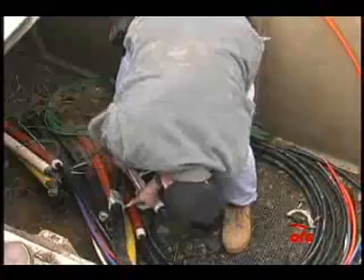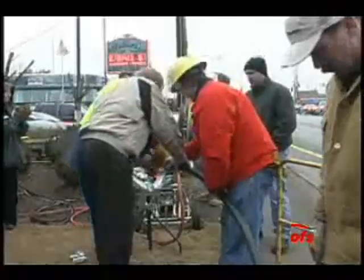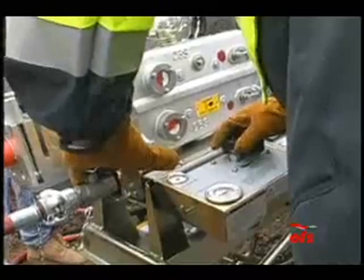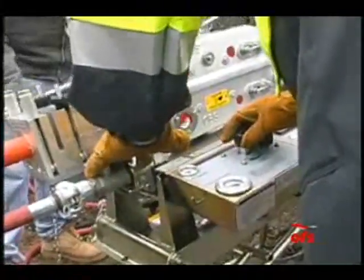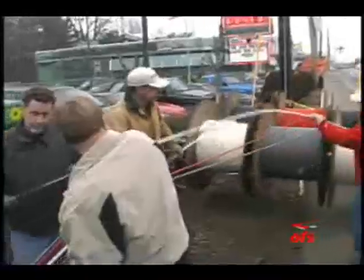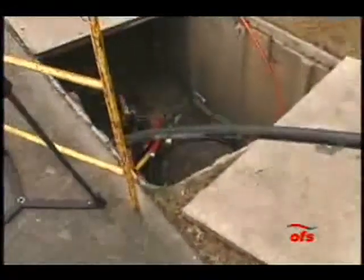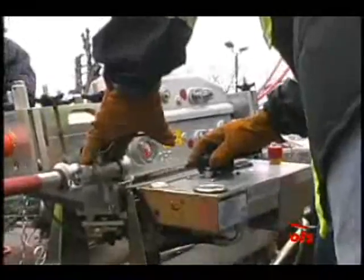A length of one and a half inch conduit was coupled onto the end of the conduit used, extending it up to the front of the Y-block. At the beginning of the installation, the microduct was pushed only by the tractor motor. After about a hundred feet, typically enough surface area of microduct has been installed to enable an airflow that will provide a sufficient pulling force, at which point airflow was introduced into the conduit through the blowing machine.